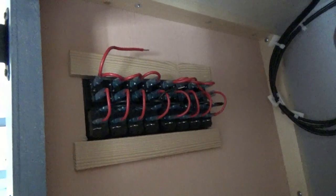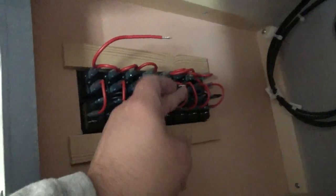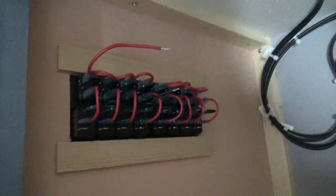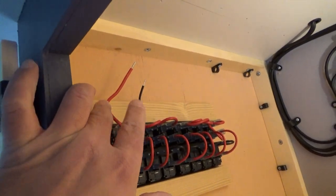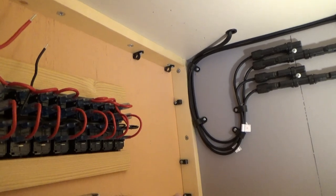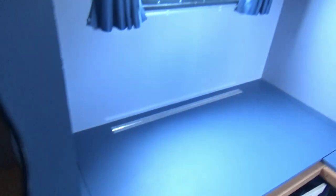We'll connect those wires and run our wiring around and down through the trailer, all the way around to the front to our distribution panel where we'll get some power set up. I'm going to get some connectors to install on here and do it the quick and easy way. We're going to get ready to run the wiring for our switch panel - we have the hot and the ground, and I've got my wire ties in place and another hole drilled down here to go under the cabinet, and we'll shoot it straight across and run it behind all my cabinetry and bench seating.